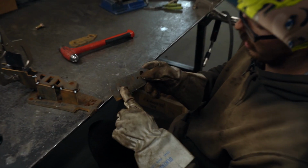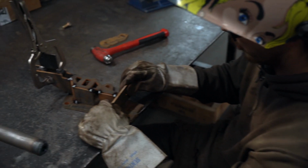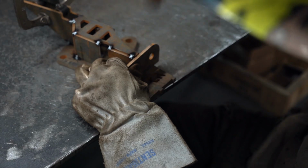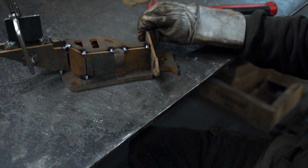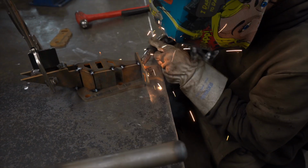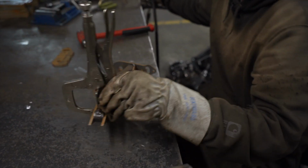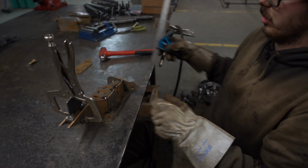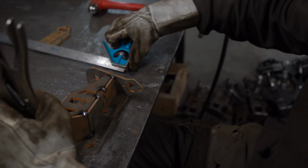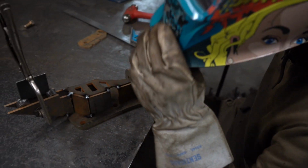What we have is our double shear ball joint and tie rod bottom piece. So that again is a tab and slot into the knuckle like that. So we'll go ahead and tack this plate in. And again, because it's a fairly critical part of the knuckle, we'll double check that it's square. And we're good there, so we'll tack the top.